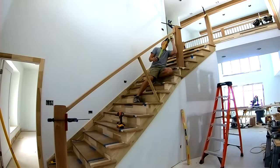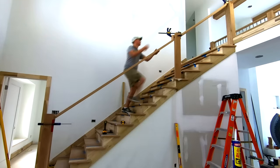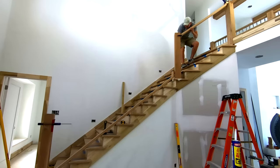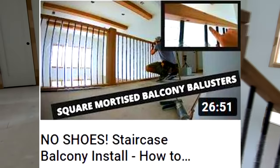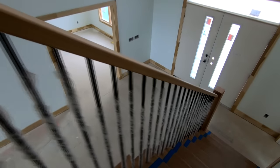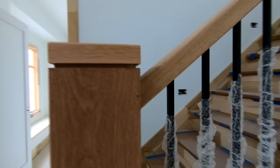At this point I'll go ahead and check all my measurements to make sure I've got consistent spacing, and then I can take the clamps off my handrail and take the handrails down. Before you take the handrails down, you may want to make some marks on the newel post so you can easily get them back exactly where they were. Hope you guys enjoyed this video on baluster layout. Be sure to check out the previous video on balcony layout and mortising the balcony shoe rail and handrail. The next video will cover how to tackle mortises on the rake, how to mortise them, how to make square mortises in the treads and the handrail with the hollow chisel tilt mortiser. Thanks for watching — don't forget to like and subscribe.